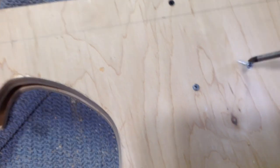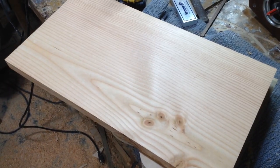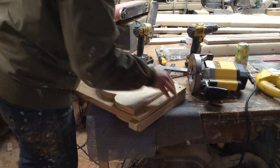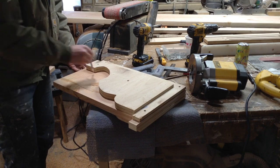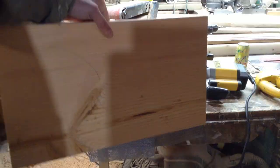I quickly realized that the half inch was too thin, so I cut another piece so that the top was now thicker. So that ball bearing - the way I had it set up now was I could remove less lumber. I made a third pattern, screwing it onto the top identically to how I'm cutting these out, just put it in the pattern and cut it out. This is my piece - like I said, there were a lot of knots in this lumber; the grade of lumber since COVID has not been spectacular. But you could see how much material is being removed, and I was able to avoid just about all the knots.